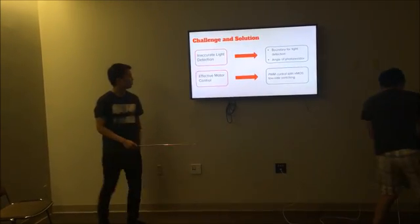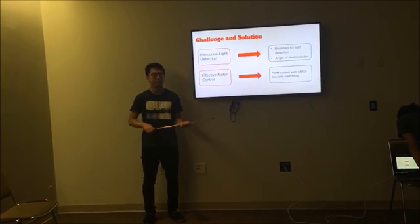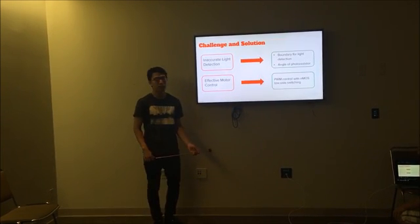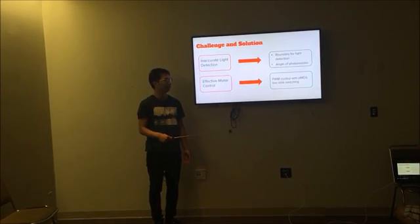The second problem we had was making sure we had effective motor control, because the motor by itself will just run at full speed when it's connected to the power supply. So we achieved that by controlling a MOSFET with a PWM signal to achieve low side switching of the motor.